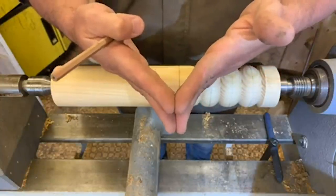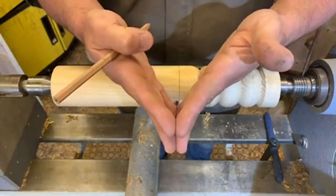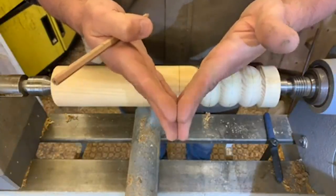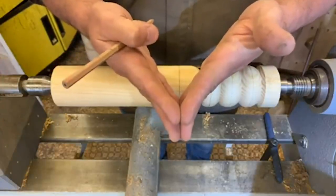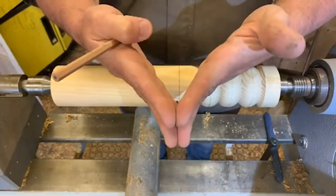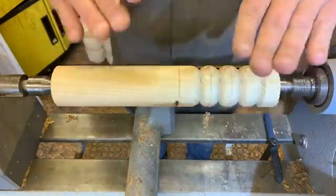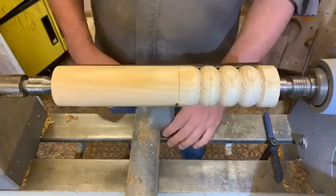You're not going to get as good a finish, but for beginners, to get you going with the skew, to lessen the nerves with the skew, that will save a lot of catches. If you're still getting catches, put a secondary bevel on. Or if you don't want to change your angle, just put a secondary bevel on the first millimeter. That will calm the skew chisel down, almost neuters it for a little bit, I would say.